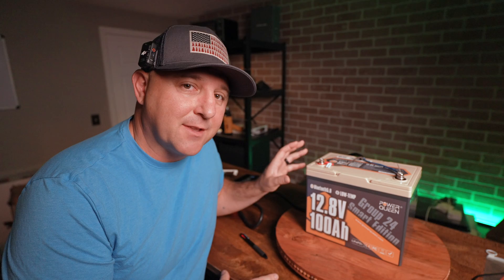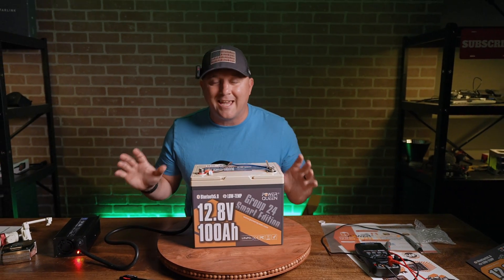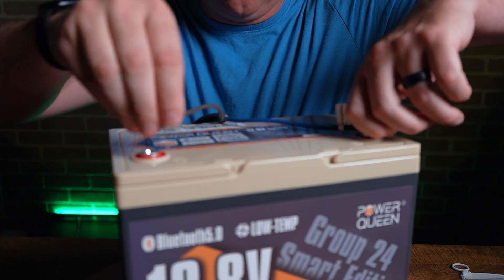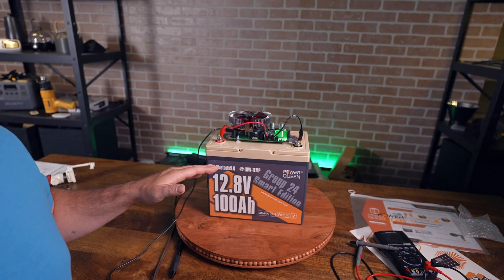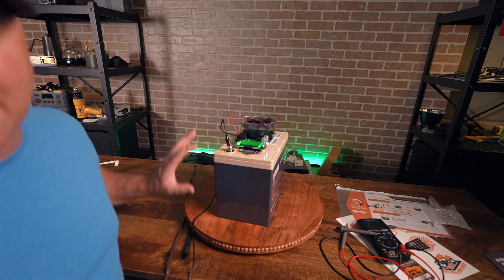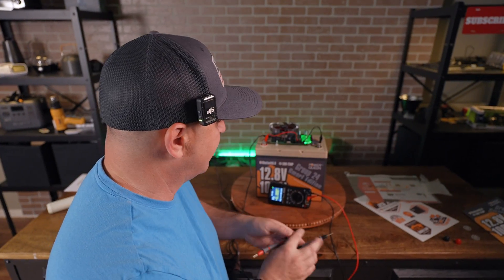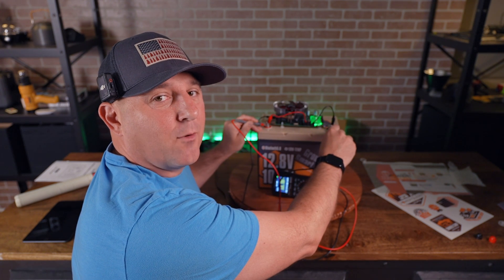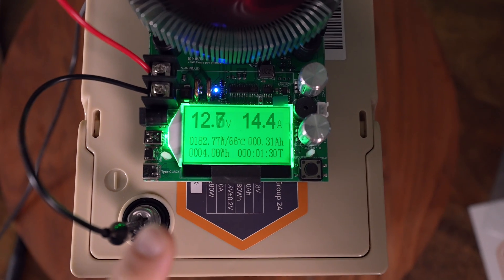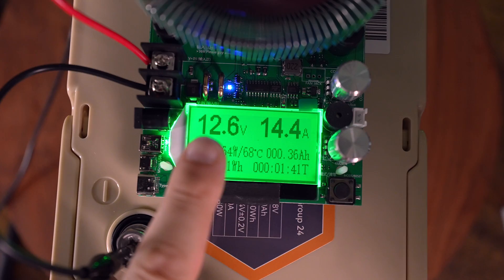To answer one of the most important questions about this battery, I'm going to do a battery capacity rundown test. I topped off the PowerQueen battery using a 14.4 volt, 20 amp charger. The system is now fully ready, with my heat dissipator attached. I'm going to turn all the dials and get this machine moving so I can measure all the power I pull out of this battery. Before testing, the PowerQueen's initial state of charge shows about 13.33 volts. My testing device pulls a maximum of 185 watts; I've currently set it to 182 watts, pulling 12.6 volts at 14.4 amps.